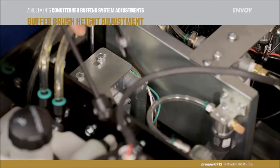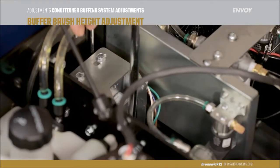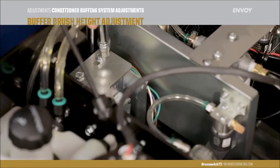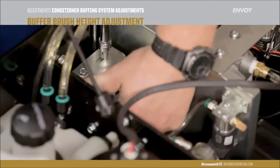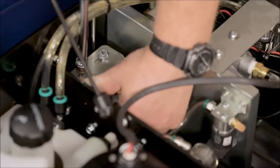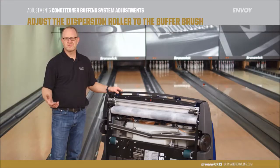So I will use the 3/8 socket, loosen all 3 screws and reposition the motor to the correct location. The final conditioning system adjustment is the dispersion roller contact to the buffer brush.